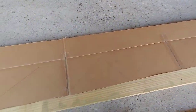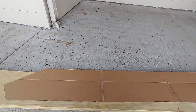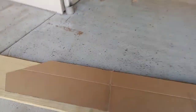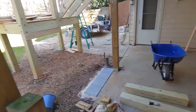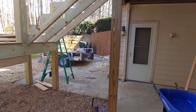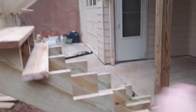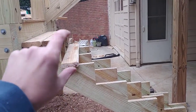Don't be confused about that. Just get a template and start marking triangles on it — all your math will fall into place eventually. I had to use two templates because I forgot to adjust for the top and the bottom stair. That's how you calculate the rise and the run, and the angle of your stringer will fall dead into place. Don't worry about the angle. On your bottom stair, after you draw everything out — draw more stairs than you need if your template is long enough — and you'll find your bottom stair becomes your base. Here's what they look like after you've taken your template and adjusted it a little bit at the top and bottom. The most important thing is figuring out that overall rise and then dividing each one in there.